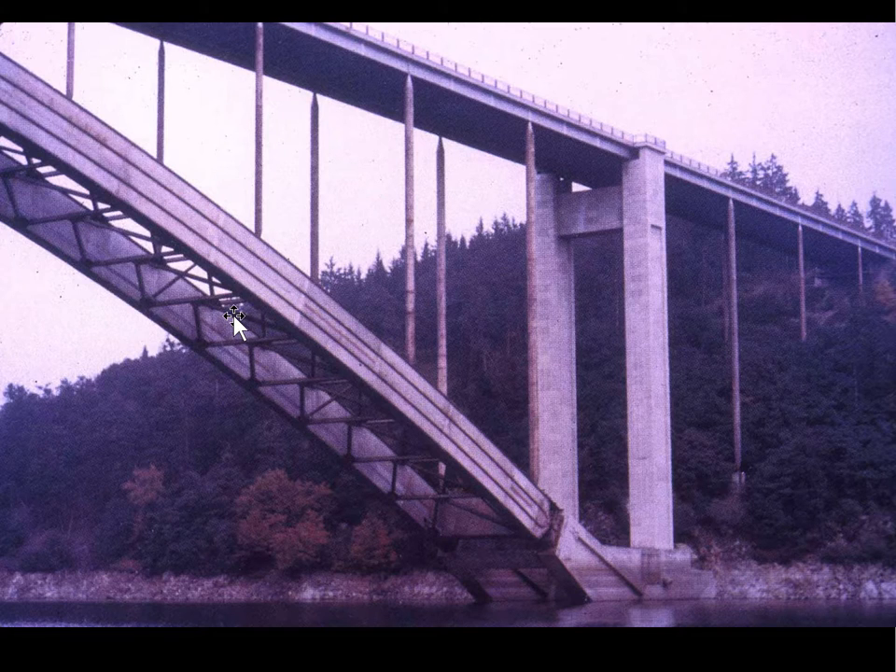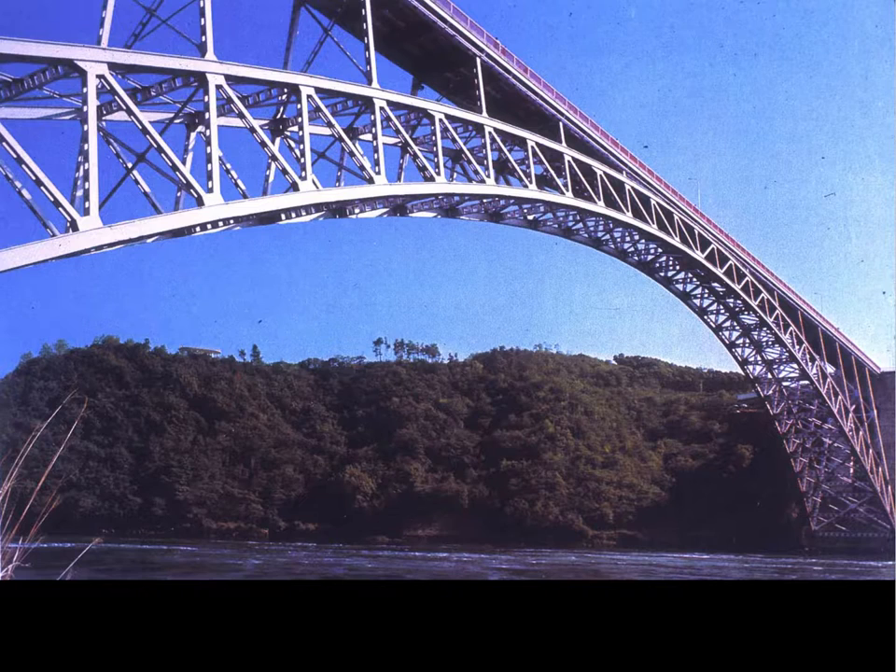Another example has K-bracing on both the top and bottom of the arch, which also contributes to beam-like action in the vertical direction for vertical stabilization. Additional K-trusses appear along the bottom. This particular arch is deeper at the ends in the vertical direction because it is moment-connected there, allowing it to cantilever over a body of water and making centering unnecessary. This bridge is constructed from the ground up, cantilevering from the foundation, like the St. Louis arch.